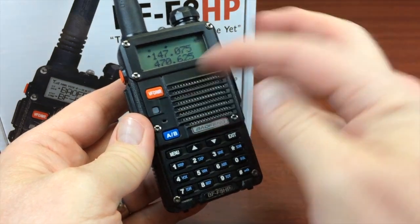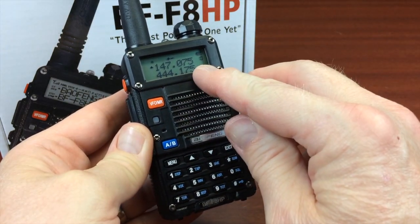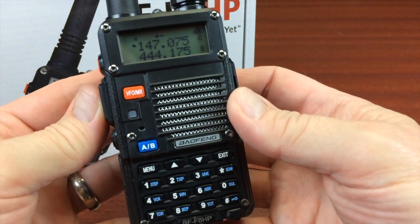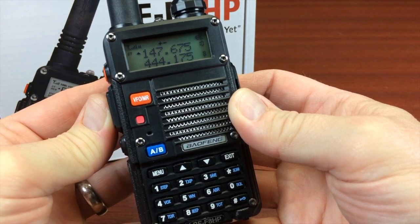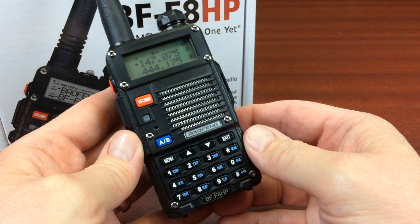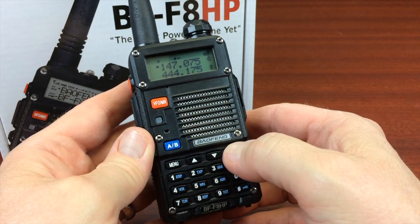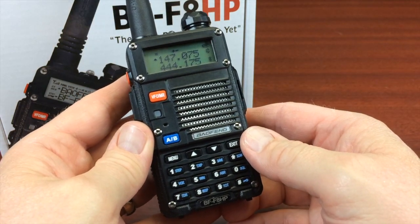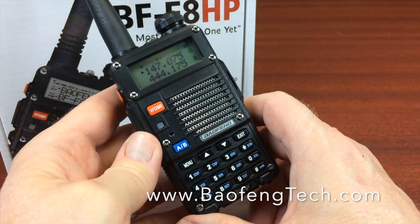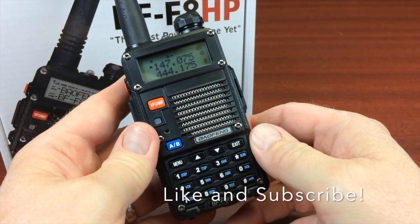I'm going to hit that button to go back and take it out of reverse mode. If I hit VFO and go to channel 10, there's my frequency. And if I key up, you'll see it switches to the transmit frequency — KI4LLA testing. So it went back. We have successfully programmed in a repeater into the memory channel and it's ready for use. Just repeat that procedure for the two or three repeaters that you want to use. That concludes the review of the BF-F8HP from Baofeng Tech. If the video is useful, give us a thumbs up, give us a like, and appreciate you stopping by.